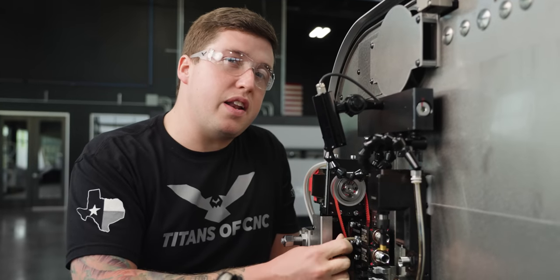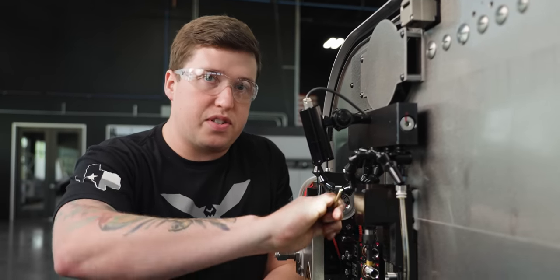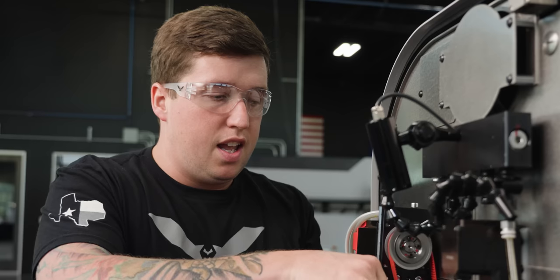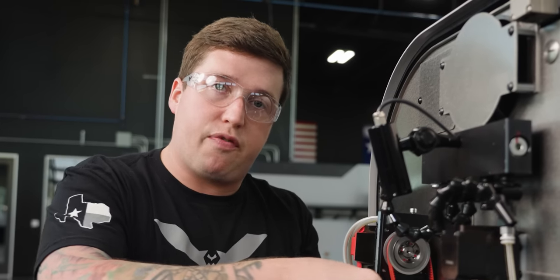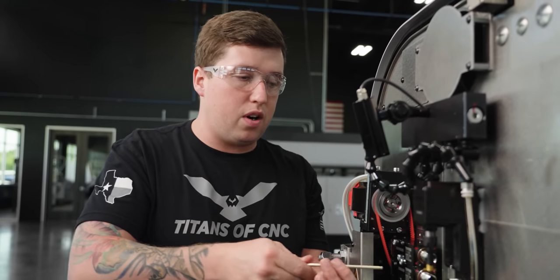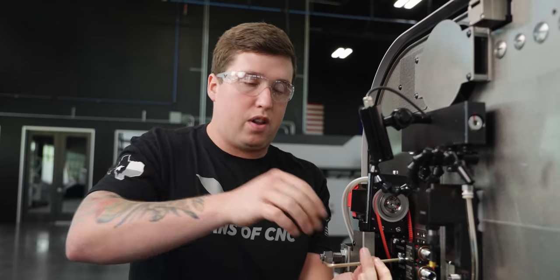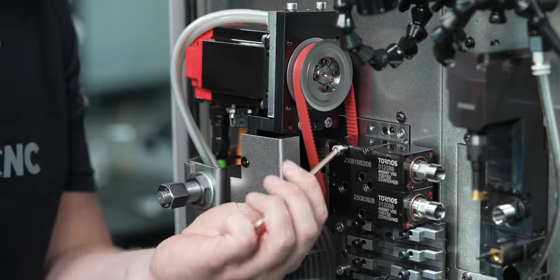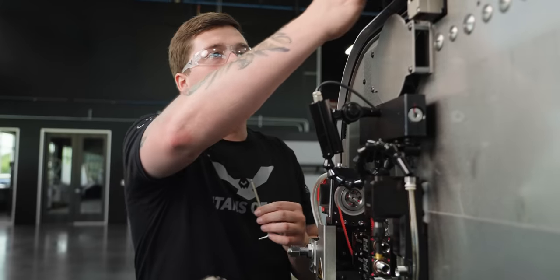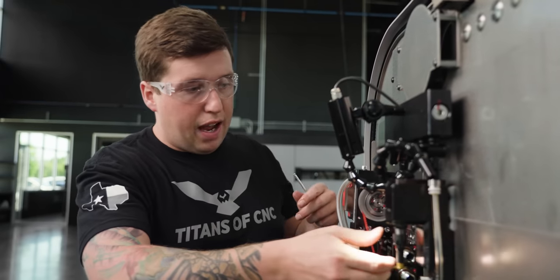So in my opinion, the reason why this is a big deal is because with Swiss machining, you have a problem with using a guide bushing. And that is, if you have to do multiple operations on a shaft or any kind of part, you have to choose your blend points. And your blend points are based off how long the bearing surface is inside your guide bushing, okay? So if your guide bushing only has 800 thousandths of support, typically you don't want to turn much longer than that, because when you suck back, you won't be supporting the part anymore. But sometimes if you just had a little bit more reach with your live tool, you wouldn't have to do that. You wouldn't have to blend and you wouldn't have to deal with all those issues. So they avoided that with this right here.